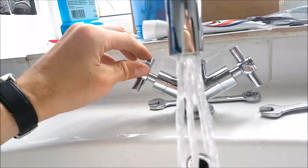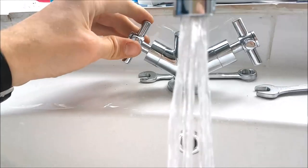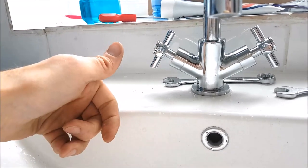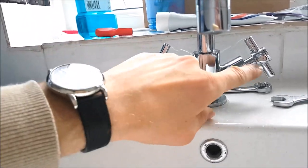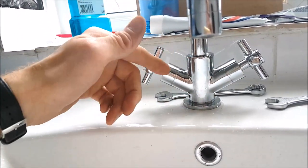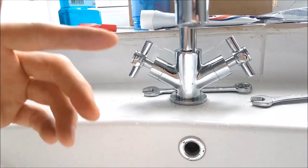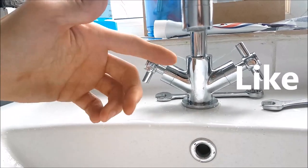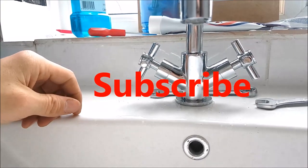That's only if the seal has gone, not if the valve has gone. So first go through the steps: have a look at the valve and the rubber seal — if you think the rubber seal is the issue, go buy one or swap cold to hot to determine if it's the seal or the valve. Anyway guys, I hope this helped. Please share, smash that like button, and please subscribe. Thanks for watching — peace.